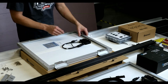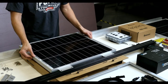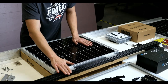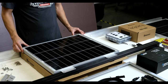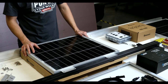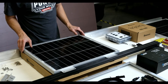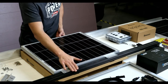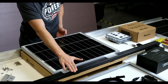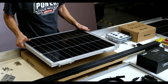All right, so we just flipped it over. And so now when we put it on our cross member, this is exactly what we did with the van behind us, now you've got it sitting down in the channel. So you're really close to being flush with your bars. So that's going to help with, as you guys know, if you got a big roof rack, a bunch of solar panels, you're not going to be stealthy, but I know people mention it. This is about as stealthy as you can get. I like this because the closer you can have it hug the van roof, remember, we still want that ventilation underneath here, but the closer you can get it down, that helps with the wind that comes across it. You can imagine if this is up high, you would have some buffeting possibly.